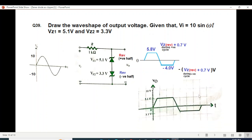The answer provided by the student appears to be not correct. What the student assumed is that the diodes are ideal diodes — so instead of 0.7 volts he considered the forward drop to be 0 volts. Unless it is explicitly mentioned that the diodes are ideal, we should not assume them to be so. I hope you have been able to follow this — please let me know through your comments. Thank you.